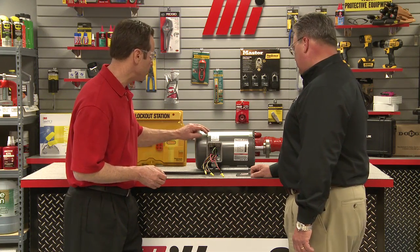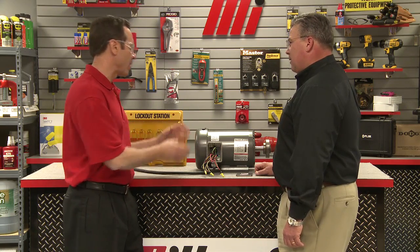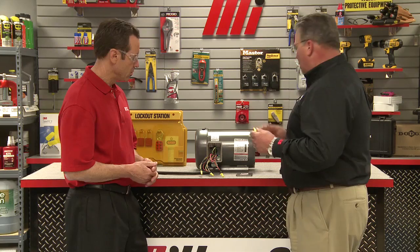Connect each of these to one of the three incoming leads for the incoming power. The plate gives you that diagram of what you need to do. In order to ensure a solid connection, it's best to use good sound electrical practice. Look at each of the wire ends and make sure each has nice clean available wire. Connection is held in place by using UL approved wire nuts and then appropriately taping the connections to make certain they remain in place.